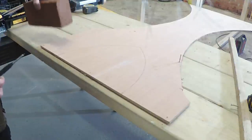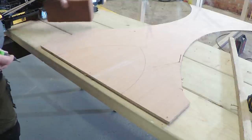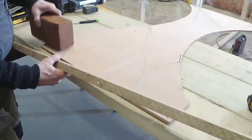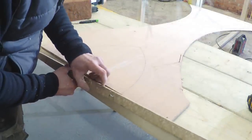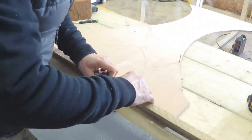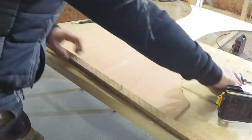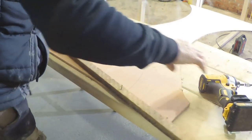But as we said, we're going to have a brick there, we're going to mark here, and then from that point there, which is the outside of the arch, we've got a striker line there. And as we said before, for this side our striking point is here, so we put this in right there. Make sure we move freely, just release it a touch. There.